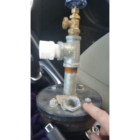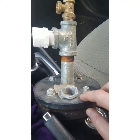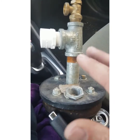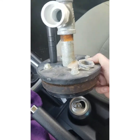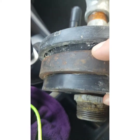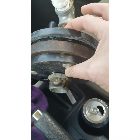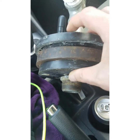This is a plastic — I call it a plastic well seal or ABS well seal — and this will hold a couple hundred feet of pipe if it's PVC, and maybe a little bit of galvanized if it's not really deep. But if you get too heavy, these plastic well seals will bust and crack in half. This right here is cracked too — you can see that little crack at the bottom. A lot of people wouldn't even notice something like that unless they took it out. It has rubber in between the two pieces, like a sandwich. When you tighten these bolts down it expands because it's squeezing, and that's what holds your pump in the well.